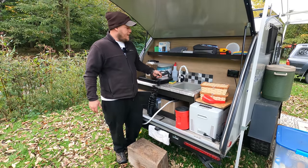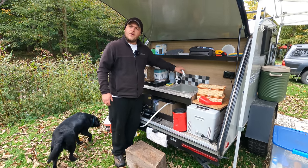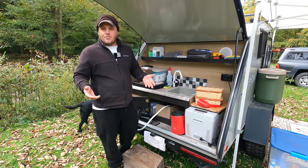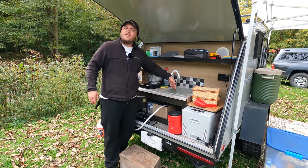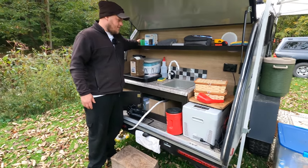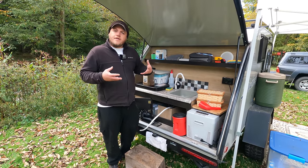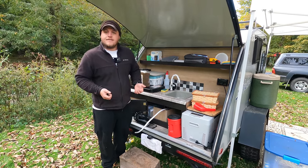When I come back to the galley, I'm going to turn the faucet on. Whether I have one of these spray nozzles or one of the aftermarket ones we make, I'll flip the switch on the pump and release as much water as we can. I don't want to dry-run the pump for a long period of time — I'm just trying to pull some extra water out. I'll do this only until it really starts to sputter, then shut it off. You can see it removed a good amount of water, pulled from the draw tube coming from the reservoir and most of the content in the pump.